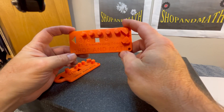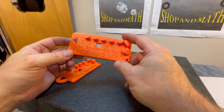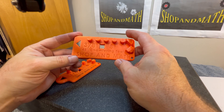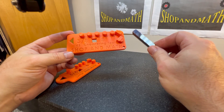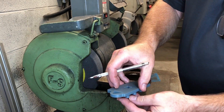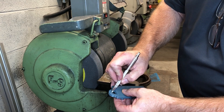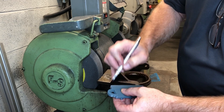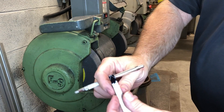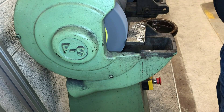I've gotten a lot of flack on the internet for making this, but it makes my students' job a lot easier. It's not for tradesmen or people who are already certified — these are people that don't know how to sharpen tools, and it really helps them out. In this clip I've already blacked up the tool bit and I'm laying out the back using the scribe lines. This is an example of what it looks like perfectly on center. In this clip I'm demonstrating how you can fit your tool.